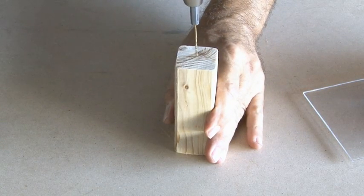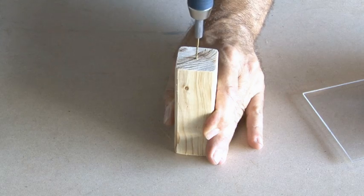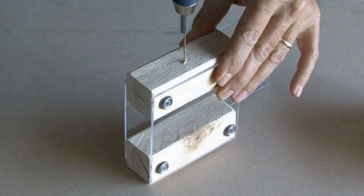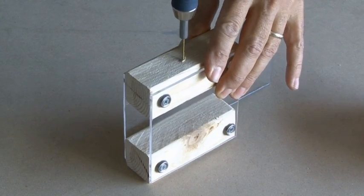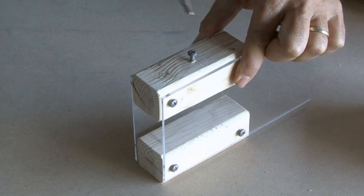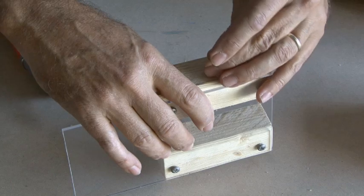The center piece of wood will also get a pilot hole because we'll be putting an eye screw right in the middle of that piece of wood. Here's a tip: use a screwdriver — it makes it easy to tighten down eye screws. Finally, a couple more pilot holes need to be drilled on the sides of our blocks of wood, and we'll be putting in a screw but not all the way down. You want to leave enough out so a rubber band can fit around it.